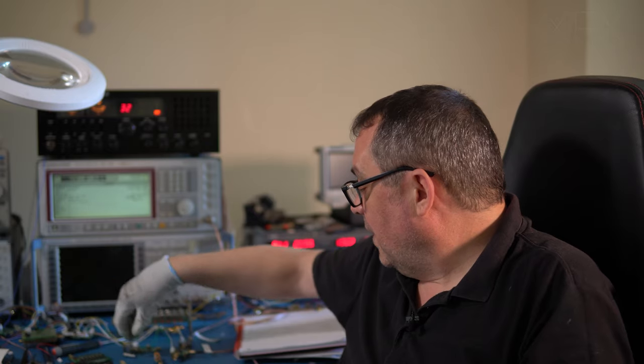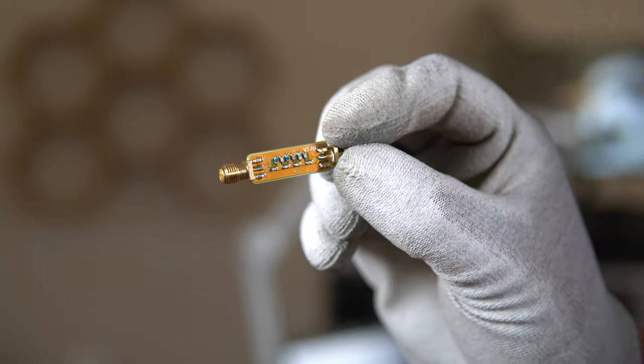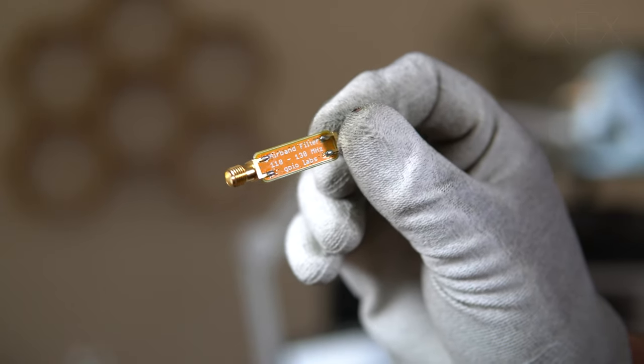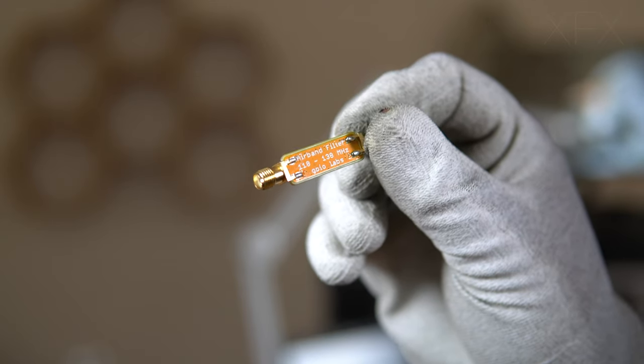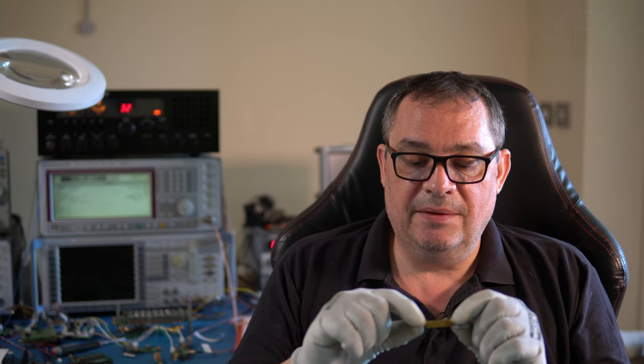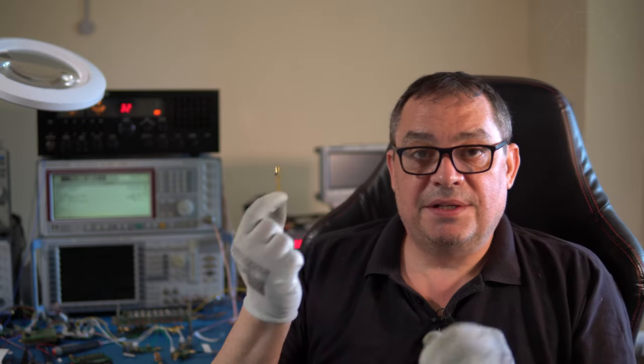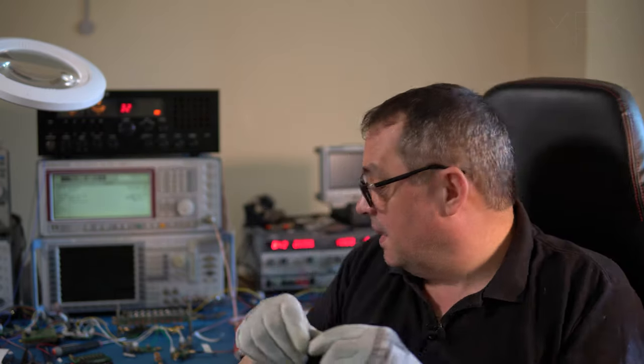So we've got other bandpass filters. I've got another one here, which I got from a Canadian outfit. I can't remember what they're called, but this covers the airband, from 118 to 138 megahertz. Tiny little thing, I think it was less than £20. Works really well. It's got very good band stop for the commercial FM broadcast frequencies. And yeah, this is brilliant. Works great with the mixer.